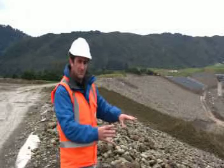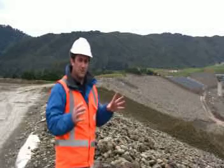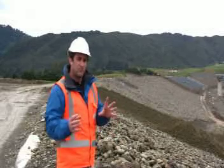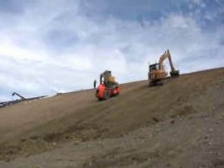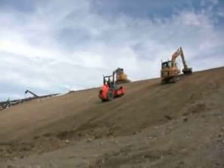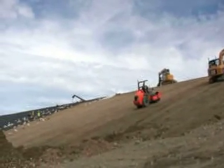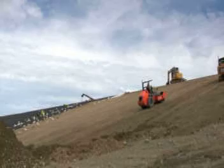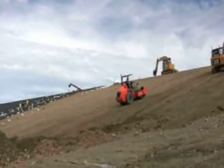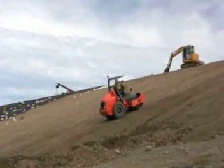So this rock is stripped, the topsoil layer is stripped, and then the underlying soil liner is prepared. The actual soil liner that you see in front of you there has been prepared. It's had between 350 and 400 millimetres of large stones taken off the very top, then 250 millimetres of filter material taken off that again, and then it's been rolled, prepared, and repaired to take this liner.